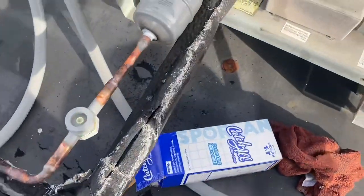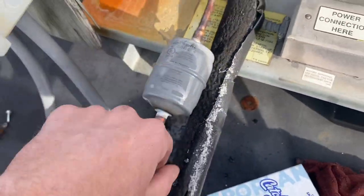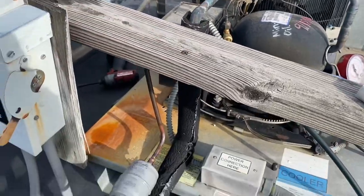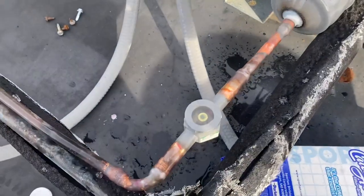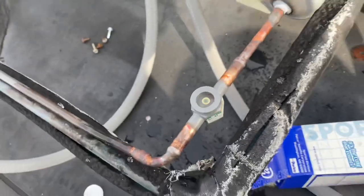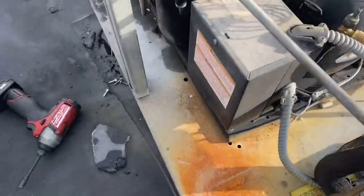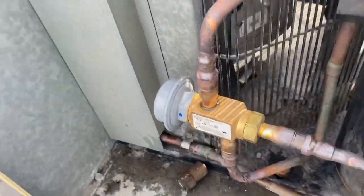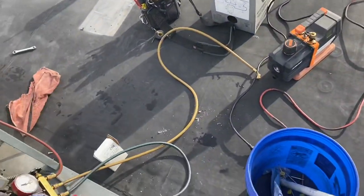That's all in and done. I always say this in my videos - always make sure your arrows are going the right way, coming out of your receiver down inside toward your evaporator. Sight glass is nice and green still, sticker's not melted - that's all good. Same thing on the valve over there too - I had that wrapped nice, so no melting of the sticker, so you know it didn't get overheated.